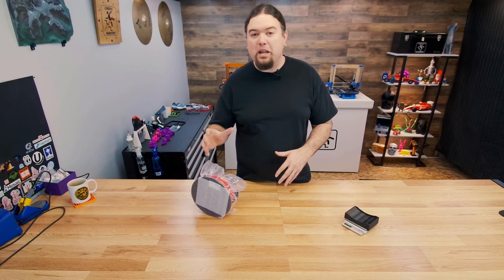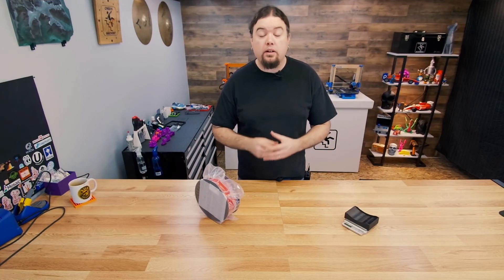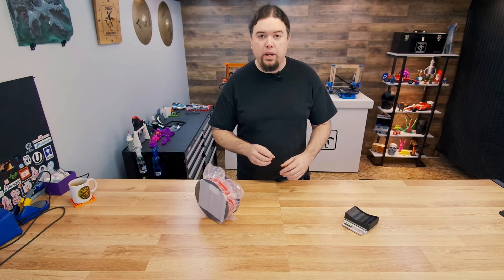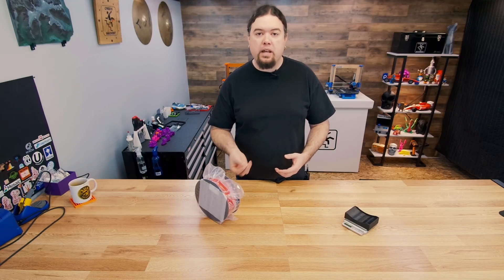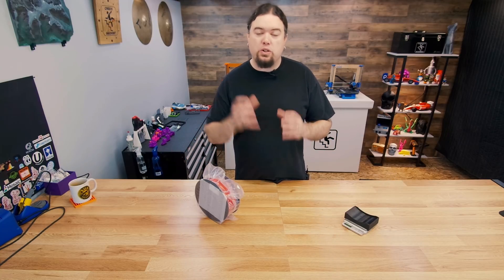Now let's talk about filament and how moisture might impact it. For this video we're going to be focused on PETG. There are a lot of different types of filament that can be impacted by humidity or moisture level, but PETG is the one I'm most familiar with. I use a lot of it down here in the basement, and as it gets consumed by the printer it's left in open air, picks up moisture, and you can see that in the print quality over time. But you can dry it out and it will resume just like it was when you took it out of the package.